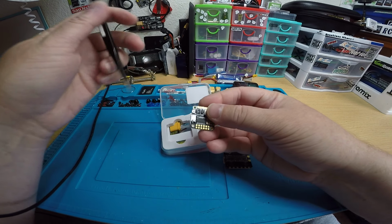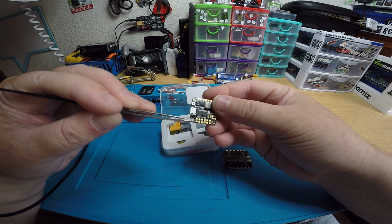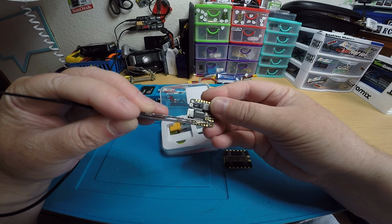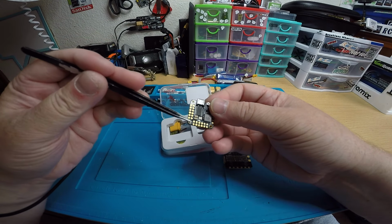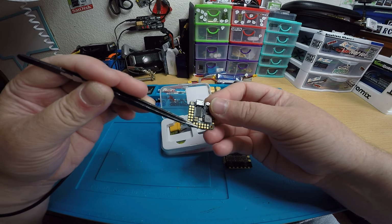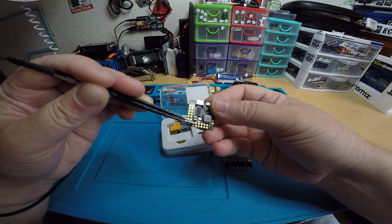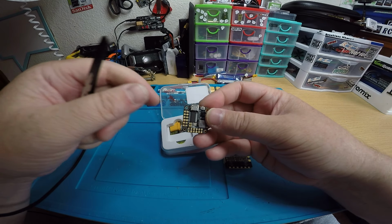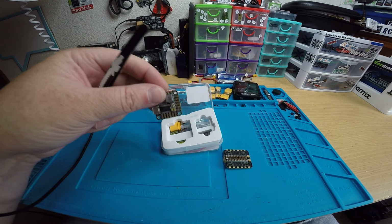Camera control. The back, let's see, you got TX6, buzzer, UART1, 2 5-volt grounds. VTX stuff is over here. Battery, ground, and then a 5-volt. So you can use either 5-volt or battery for your VTX. Another UART, 2 more UARTs. So there's 4 UARTs. Probably 5 UARTs. Let me look.